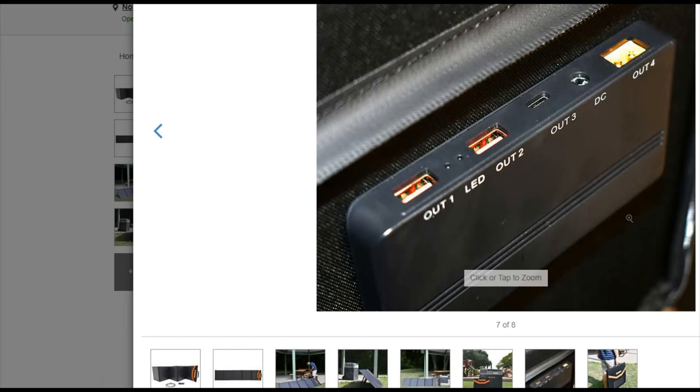This is my first solar panel, but I was out at 10 in the morning and if there's sun it's working. At 6 in the morning the sun is really low so you won't get 200-300 watts, but you'll get something — even 100 watts. I would have been happy with 100-200, but having the extra capacity means even in bad conditions you still get a good chunk. If conditions are poor and you only have a 100-watt panel you might only get 50 or 30 watts, but if you have a 300-watt and it gets half — that's still 150 watts. Over-speccing is always the way to go.